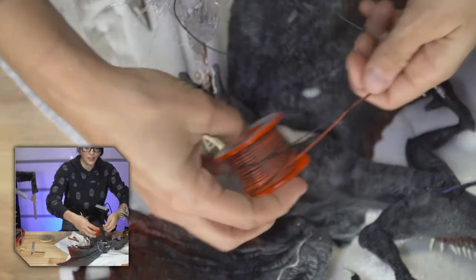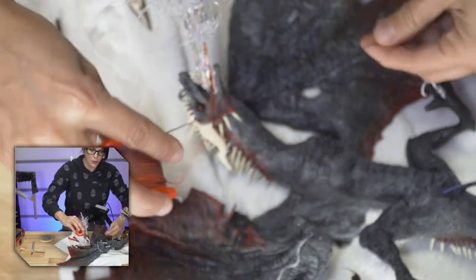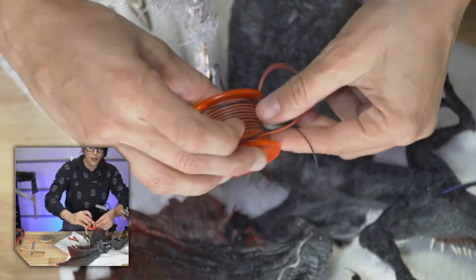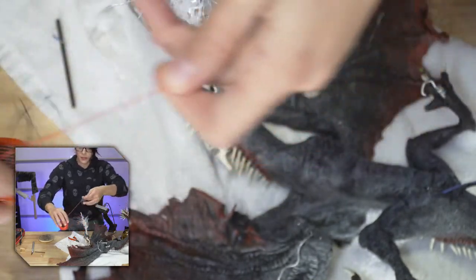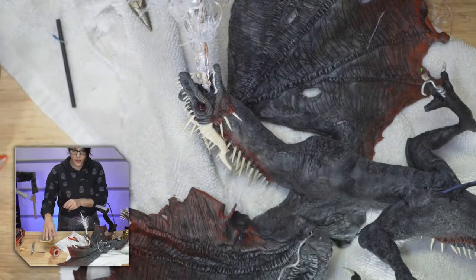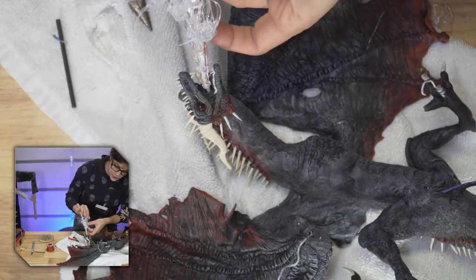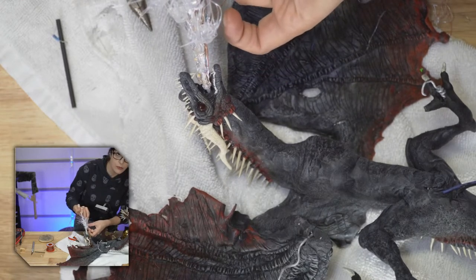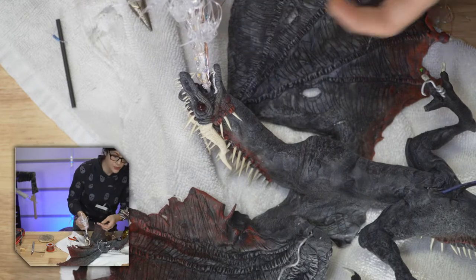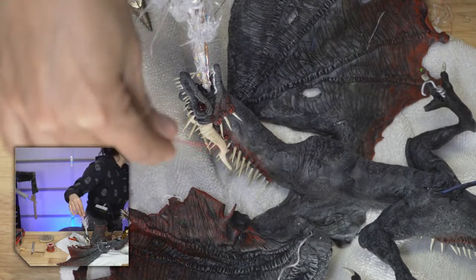Fine, I'll force you. So yeah, this is a little 30 gauge wire, about the size of what we're working with, maybe a tiny bit thicker. But the specs should allow us to work with it, and not have it overheat and all that kind of stuff. So I'm going to go ahead and strip a bit of it and put some right here. And I'm going to switch to the other camera. Actually, let me strip this first.